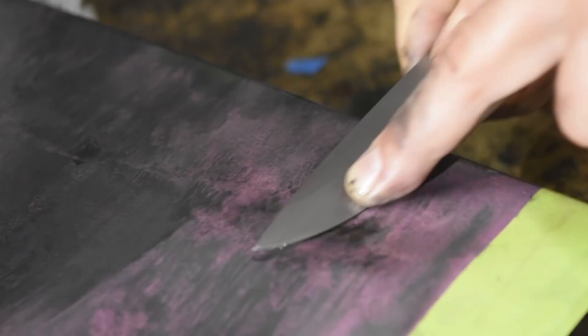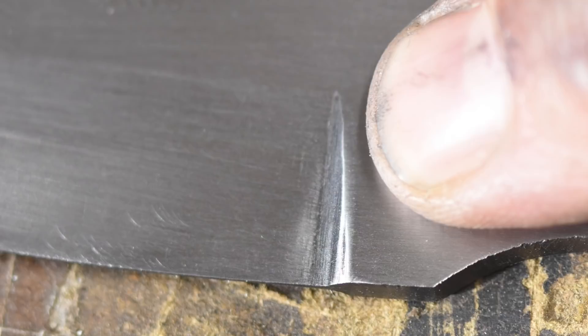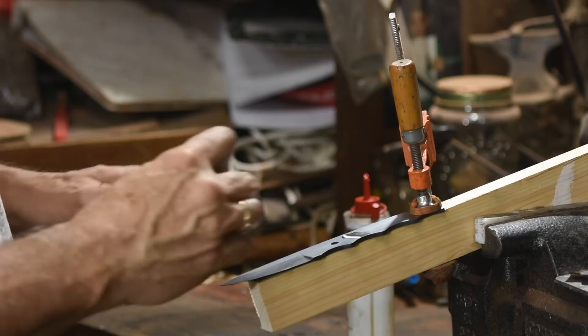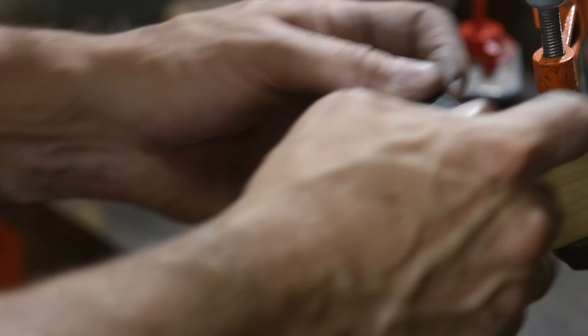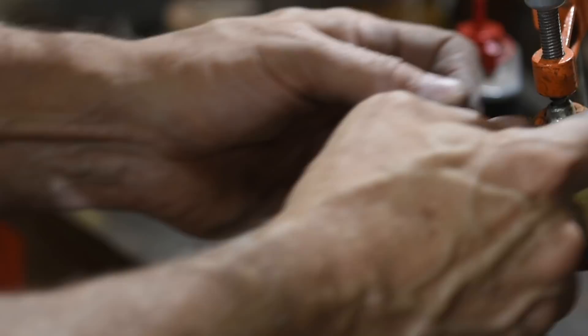A little flattening on the surface plate, then I'll turn to the sanding block. You really want to give plenty of attention to the plunge line, to make sure you haven't left any scratches there. That's the hardest place to work and the easiest place to neglect. Today I'll take this up to about 600 grit, going 120, 220, 320, and then finishing up with 600, which gives me a soft, kind of matte finish. That's completely a personal decision. If you like shiny, you can go up to 2,000 grit — whatever floats your boat. There are plenty of even higher grit sanding products than that if that's what you like.